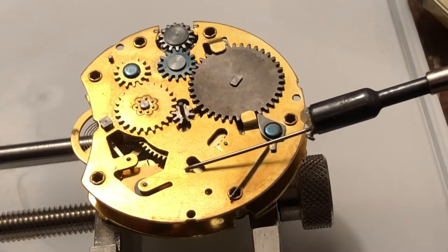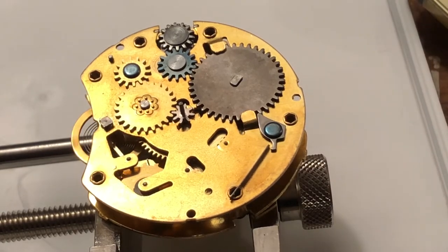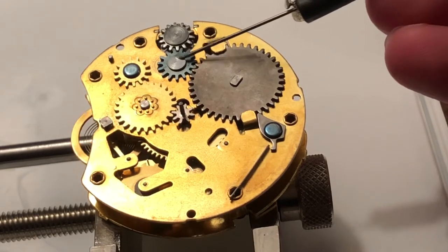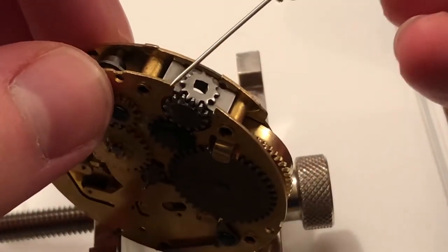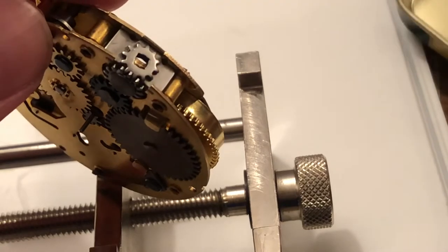Usually these clocks and watches — oil actually takes a few minutes, or actually a few hours to soak in, from what I've seen. Sometimes performance will increase after hours of running, after being first oiled again. And this thing hasn't been oiled since '64. Going to dab a little bit down here somewhere. Because these wheels here — these are all riveted to the front plate, but they still need something to keep them going. Get that up in here. I'm going to oil up top here as well, because that spins a lot and there's wear there from what I've seen.